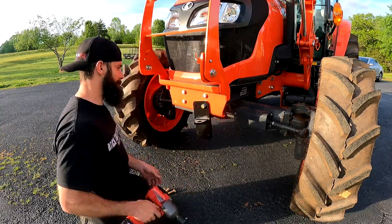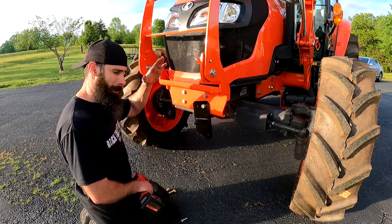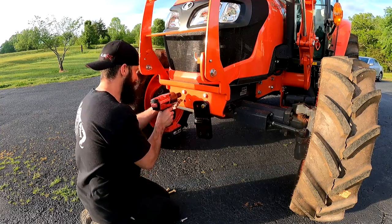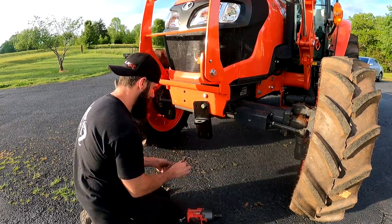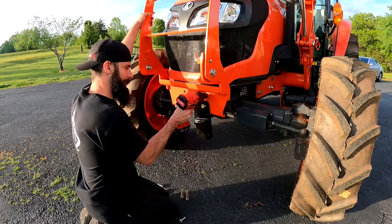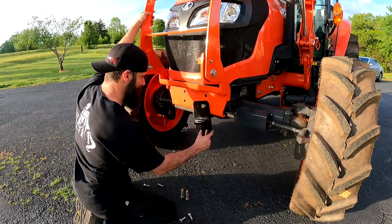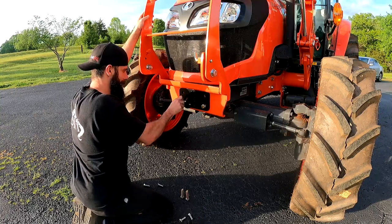Okay. Now, you're gonna take out all the rest of your bolts, but now your bumper won't fall off. And surely you're strong enough, whoever's doing this, to hold it from clocking side to side so it don't hit your hood. So next, take the rest of these out. Go ahead and switch your washers before you get the last one out. That way you've got some free hands. Make sure you catch it up here. And see there, it didn't even move. Well, it tried to a little bit, but pretty much effortless. Now just rotate it in place, and it is a lot easier to handle.